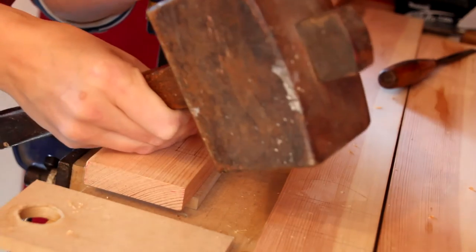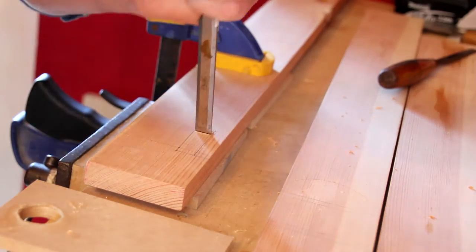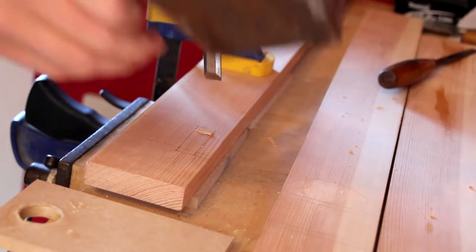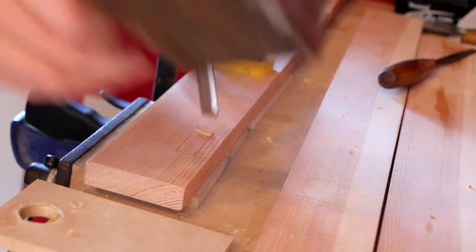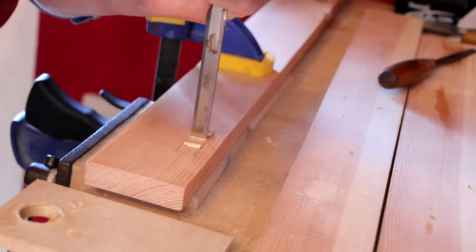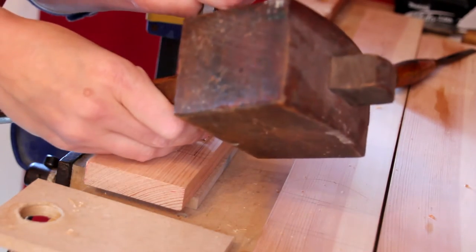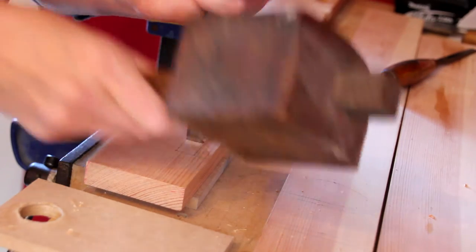The other runners that go underneath that hold it onto the bath, I wanted these to be adjustable. I'd taken measurements for the bath, but just in case the measurements weren't completely spot on or the bath was actually curved, in case it needed to be moved up and still held tight, I put them on a slider. So that meant putting a couple of bolts through the bottom layer and into the little sliding runners. And I decided to just add a butterfly nut on the bottom for adjustment.